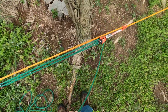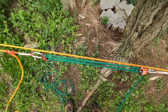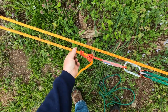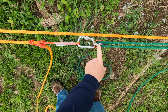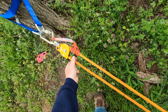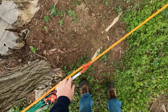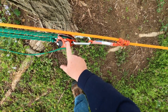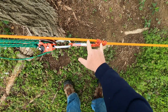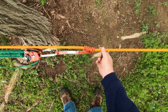What is the mechanical advantage of this system? This is going to be a five-to-one configuration on one end and a four-to-one configuration on the other end. Our input is a four-to-one, so we have four tensions coming in from the back side of this set of fours. Four tension comes through the pulley, comes around — four — we follow that all the way until it hits our rope grab which has five T on it. So this is a nine-to-one, because we always add our tensions at rope grabs. Four coming in, five because of this — nine-to-one.